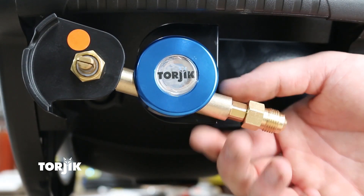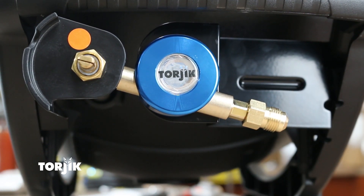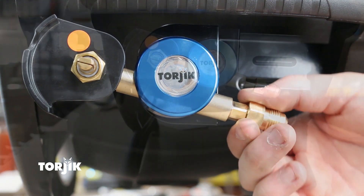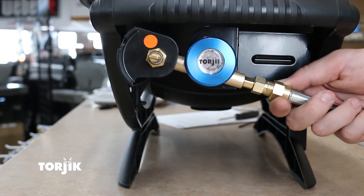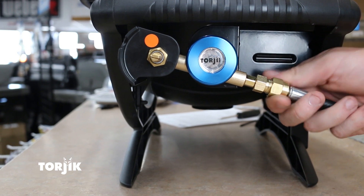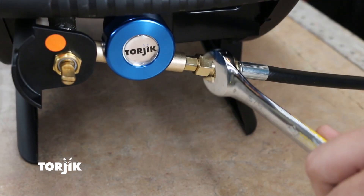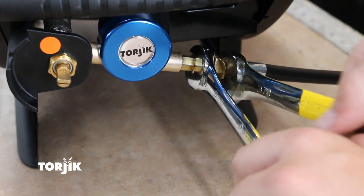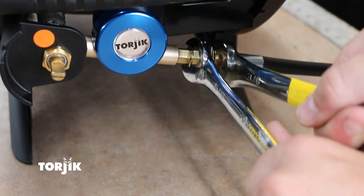If you purchased the Q2 Plus version of this kit, you will not need to do the following step. Using two wrenches — one on the gas feed tube hex and the other on the female nut located on the end of the supplied hose — attach the female end of the hose to the male fitting on the end of the brass gas feed tube. Do not use pipe joint compound or tape on this union. Tighten securely.